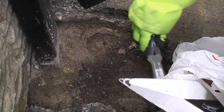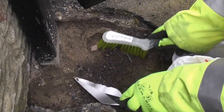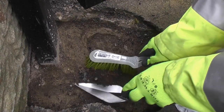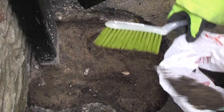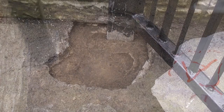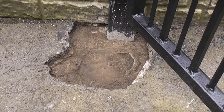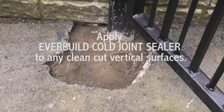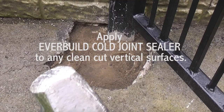As you can probably see from the video it has started snowing, so we're going to get this down pretty quickly. The first job is to clean out the existing hole and make sure there's no loose debris or anything in the hole. This is the hole we're going to be repairing. As you can see I've already cleaned it out. The only tools you're going to need are a trowel to put the tarmac in and then something to tamp it down, such as a heavy club hammer.